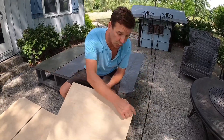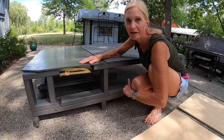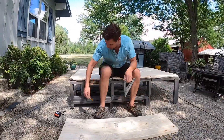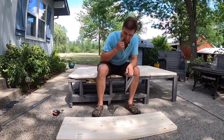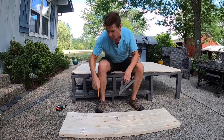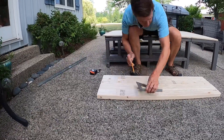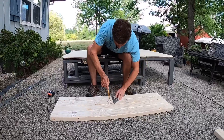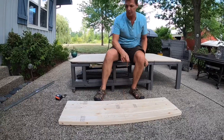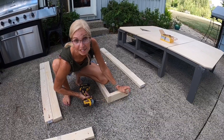Two of the sections we notched out the corners. The next step is we're going to build the two-by-four frame that supports the bed — ouch, she got stung by a bee! First, I'm going to make two rectangular sections with two-by-fours. I'm taking my longer pieces per the instructions — link will be below — and laying out where the two-by-four supports are going to be, pre-measured and marked off. That allows me to know exactly where those two-by-fours will be laid out. Then we simply assemble using three-inch deck screws.